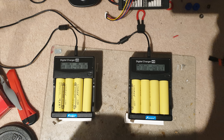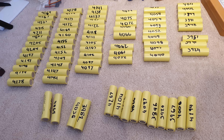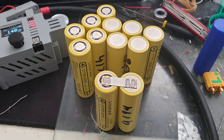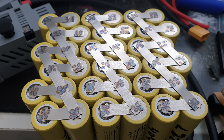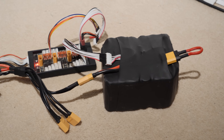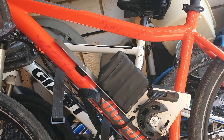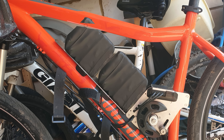To complement the new motor I decided to build a new battery pack. I had to cycle charge every cell to measure their capacity, which took just over a week. Entering all the values into a website called Second Life Storage calculates which cells should be put into parallel groups, and I could then spot weld the negative of one cell to the positive of a cell from another group until I had six pairs. I repeated this to make a pack of six in series and six in parallel, then added power wires and a balance lead. I choose not to run a battery management system, preferring to keep batteries simple and using my charger to manage cell balancing — giving a 22 volt 24 amp hour lithium-ion pack, with a second identical pack wired in series for 44 volts.